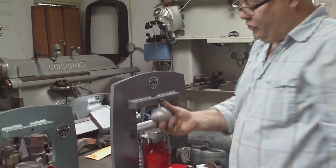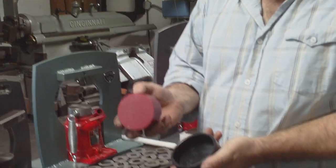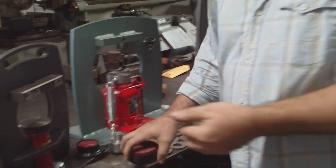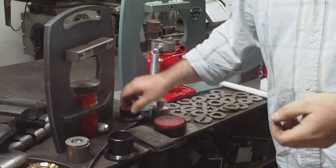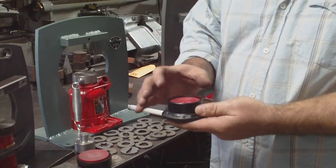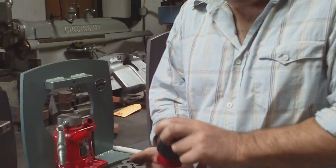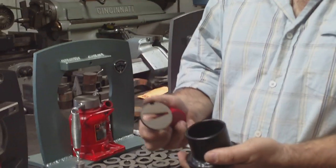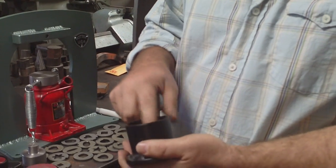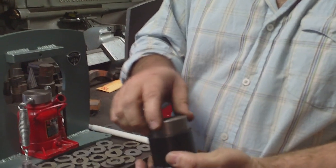I have several different diameters and radiuses of pushers, and we also make contained urethane. I like to use the 90 durometer, and it's contained in these containers. I have three different kinds: this is my low one for forming flatter objects so you can see what you're doing. This one here is designed to work in conjunction with the silhouette dies — the reason it has high sides is so you don't accidentally shoot things across the room; it contains and guides everything in there.